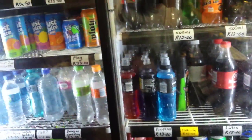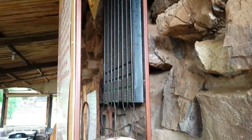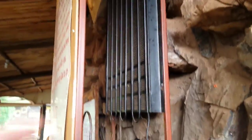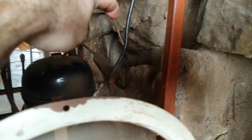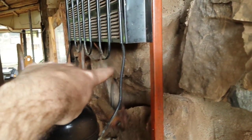I'm going to take you around outside and show you the compressor. So here we are outside the shop. This is a normal condensing tray that comes off a standard 250 liter upright fridge that I bought off a friend for 100 bucks. This is a very old fan, and over there you can see the compressor — a very small one-fifth horsepower. Like I mentioned, it draws less than an amp of electricity. It's got a normal 0.66 capillary tube and I've used one and a half meter length, so for roughly 30 meters of copper pipe you'll use about 1.5 meters of capillary tube.